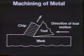What we see is that we have many methods of shaping material by cold deformation — lots of different processes, some very similar to hot working processes, that give us a finished product in ferrous and non-ferrous materials. With ferrous materials we always have the advantage of heat treating the part. If recrystallization has occurred we can heat treat it to make it strong again. If the strengthening mechanism comes from plastic deformation alone, we need to understand that as well.